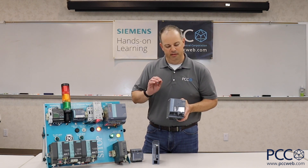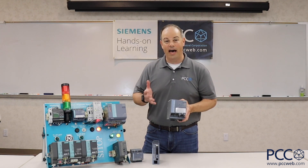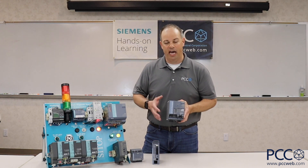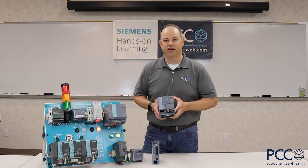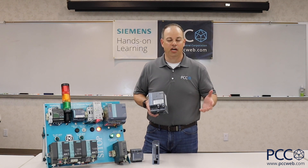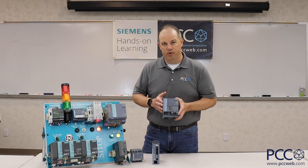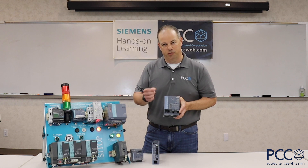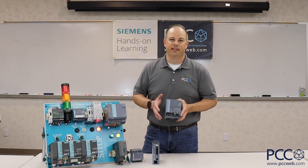To wrap up: diagnostics on a 24 volt DC circuit can cause a lot of downtime if you don't know what's going on. If you've got 20 sensors and you don't know which one has worn insulation on its wiring causing a short circuit, hunting that down can be very difficult. But if you have the proper diagnostics on the output of your power supply, you can narrow it down to specific circuits and get that diagnosed and reset very quickly. Thanks a lot for your time.